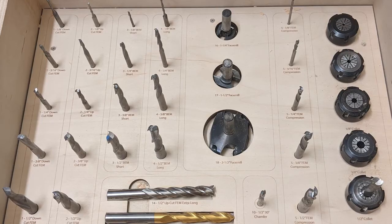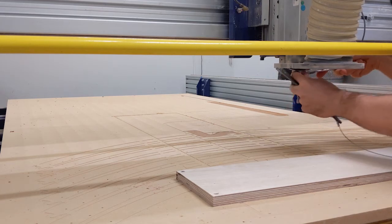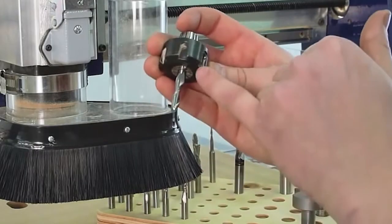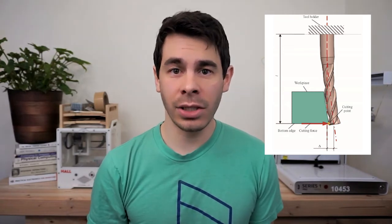Once your work is attached to the bed, you'll need to locate your origin point — normally in two separate operations, one for the XY plane and one for Z height. Open the bit drawer to find the bit you want to use, match it with an appropriately sized collet, and thread it onto the spindle. Use the collet wrench and spanner — attached to the spindle interlock key — to tighten the bit. For stick-out, insert the bit as far as possible without biting down on the flutes or allowing for collision with your workpiece, as excessive stick-out introduces runout and unnecessary stress on the bit.